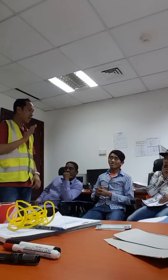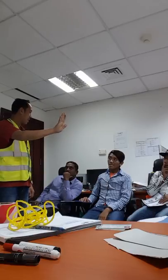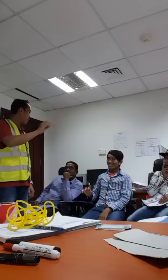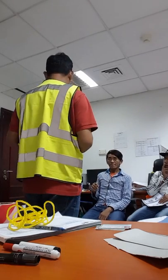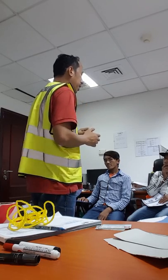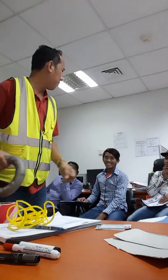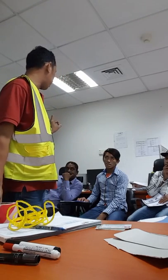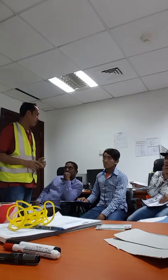You attended before, that's why it is very important you need to remember. The hand signals are a requirement for a rigging, slinging, and banksman person. You also need to know the types of lifting gears: shackles — this is a shackle, very heavy. Also: lifting belt and wire rope. You need to know all of their names and what they are used for.